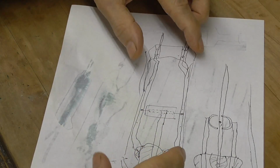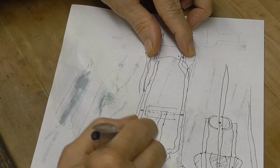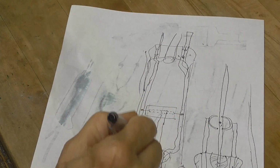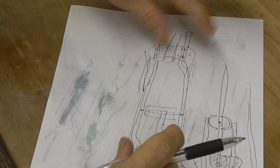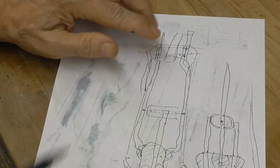Okay, and then once we get that in there and we get this end sealed, we'll then reheat this pinch and pinch it to make the seal, and that will seal off the tube. And then, of course, on one end or the other, we'll put an evacuation stem to pull a vacuum on it. Okay, that way we eliminate the problem of trying to work double-ended on this thing, because the only thing we'll be doing is shoving it down, and we just have to make sure that our two tungsten seals end up in the pinch, and that'll be very easy to do compared to trying to align all this other stuff.